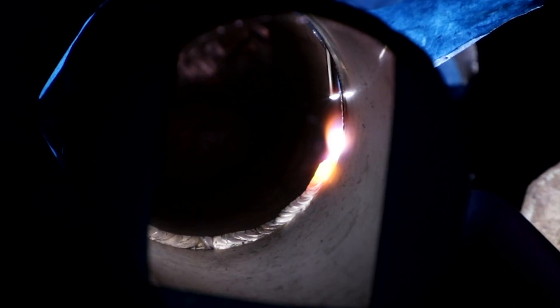Dip it. Dip it keyhole. That way I'm not putting too much heat on the pipe as well. When you're welding 6G, I really recommend learning to use your left hand, especially when you get out there in the field. It's a lifesaver — sometimes you get in some spots that you just cannot get into. If you look, the gap is getting a little bit tighter. All I've got to do is dip in keyhole and that gap will open up just how I want it to. Boom. Stop right here.